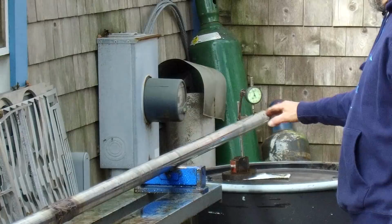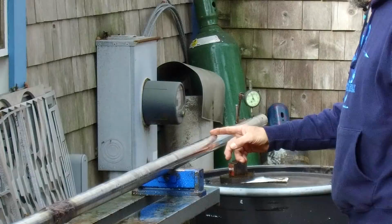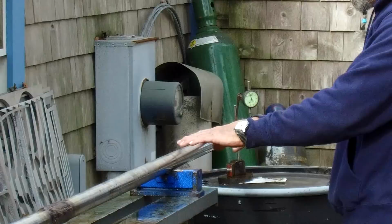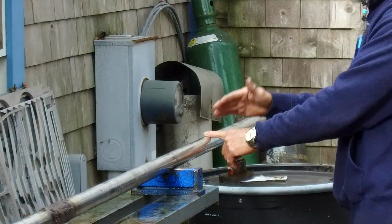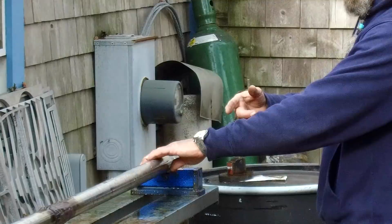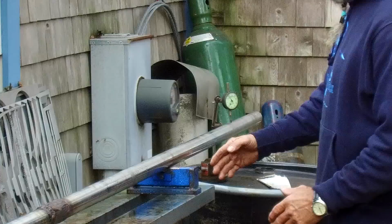I'm going to move the barrel over here a little bit, and I'm going to pick this middle spot right here, and we'll see if this is about 15 or so, then we kind of know that the bend is in. We want to find out where that initial bend is at in here. If it runs true, and then all of a sudden we start seeing it going, then we know the bend is here. And that's how we're mapping it out to find out what it's going to take to get this to running true with the rest of that shaft. And then we'll know that from here all the way to that roller over there is running acceptable tolerances in my shop.